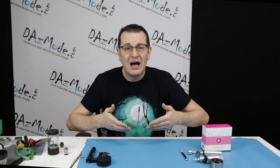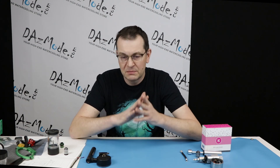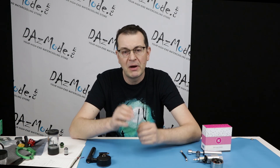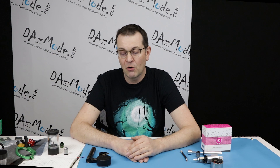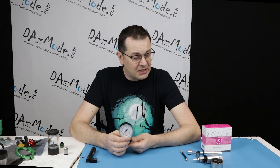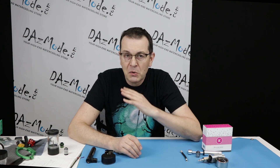You test without power, yes. But if you actually pour enough, that requires drying — a few days and who knows how many hours of labor if you actually need to detach the block, for example from a GPU. If water gets between the two, I wouldn't recommend drying it without taking it apart. Better to completely disassemble, dry it, assemble back. No harm, just maybe three days lost. For that reason, using a pressure tester to pressurize your system with air and see if any escapes just removes all this potential hassle.